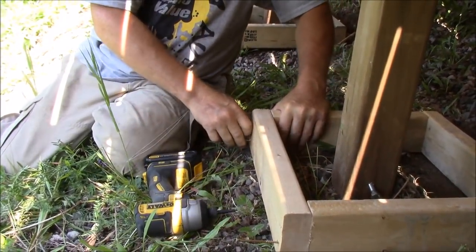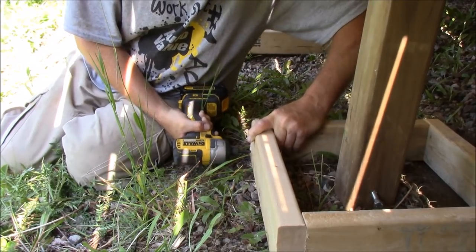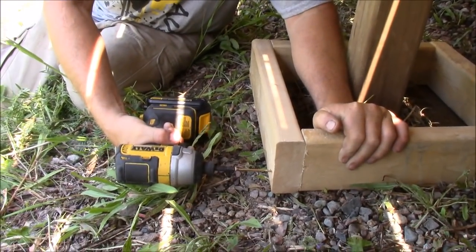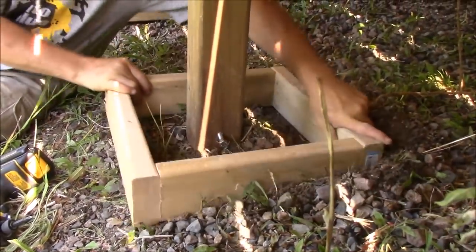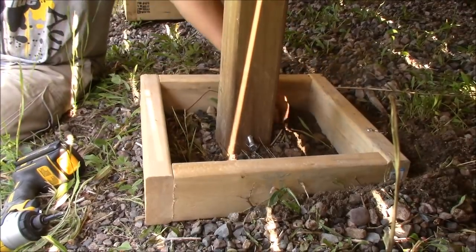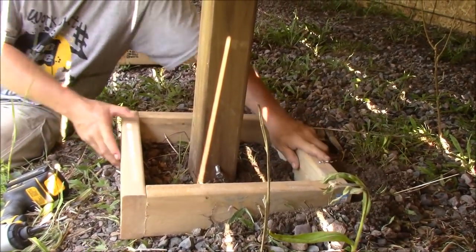I know this probably won't work if you're in an area where you have building codes — but there are no building codes here. I would rather do it this way with some bolts in here than buy those deck bricks, deck stones, whatever you call them, where your little 4x4 sits into. I'll just put some of this around here a bit, then we mix up our concrete just in a wheelbarrow. They just bought bags of ready mix. So there's what it looks like — that's one form and we'll fill that full of cement.